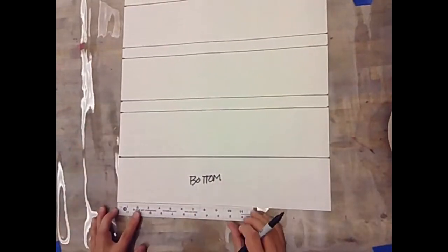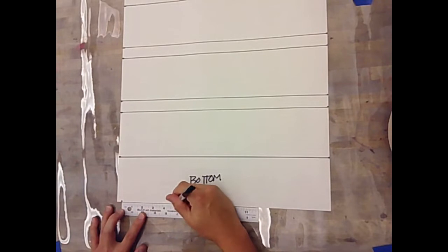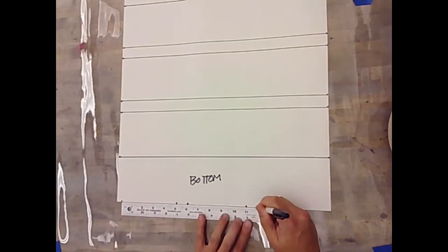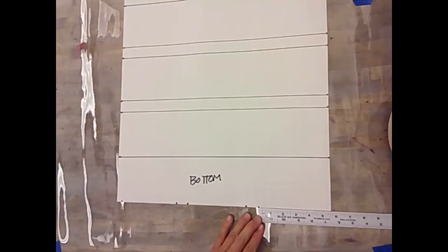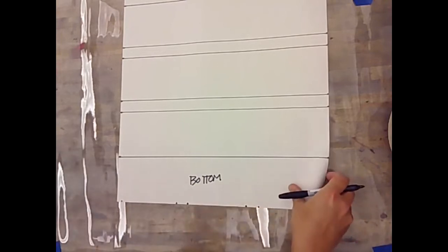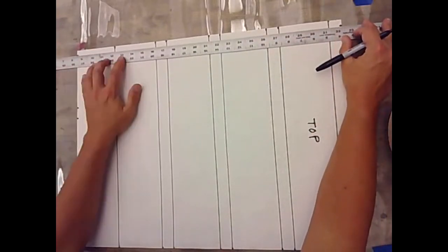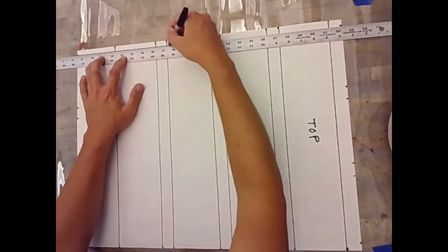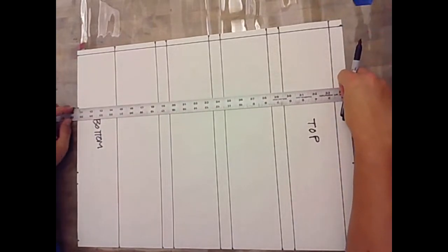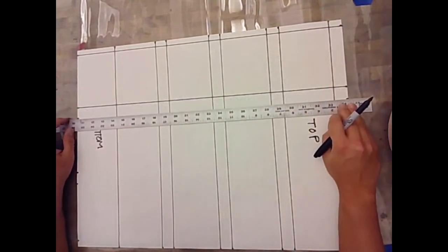So I should have a half inch margin on left and right hand sides, one inch in between, giving me three even five inch spaces to work. I'm going to do the same thing at the bottom edge. Half inch, five inches, an inch gap. Five inches should bring me to 11. One inch gap should take me right to 12. And there's my five inches with a half inch left over for my margin. Now if I connect these lines on my outer edges and draw all the way across — you're doing that with a pencil of course — you should now be able to see the layout starting to emerge.